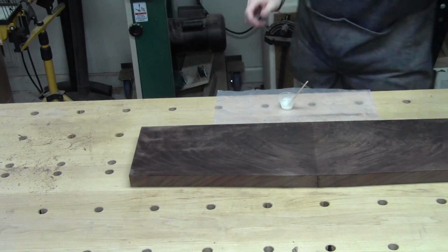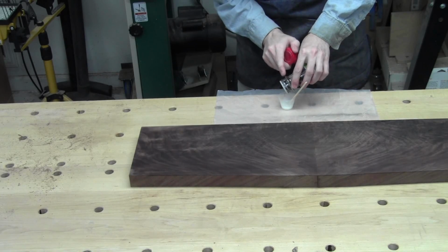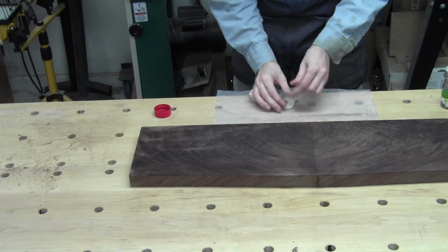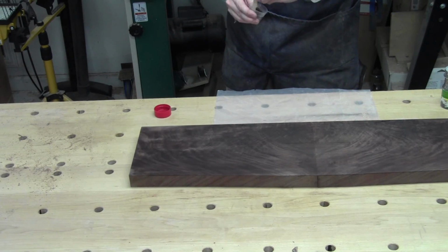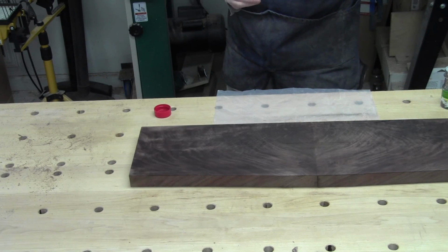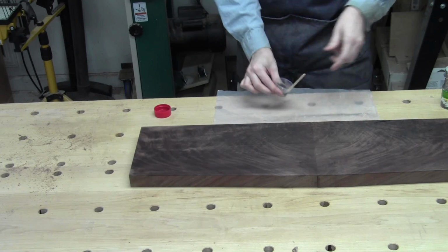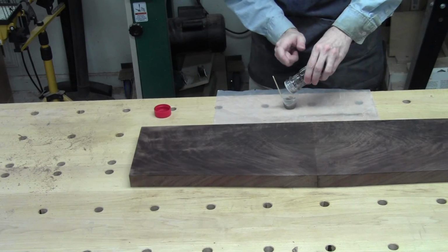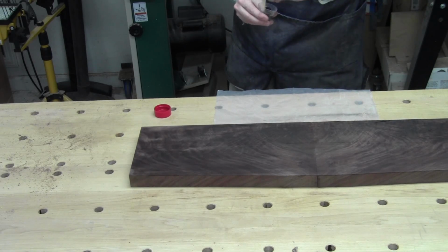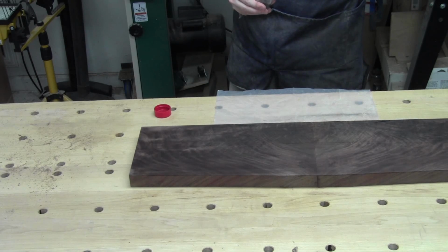Okay. Ebony sawdust here. Just sprinkle a little bit of it in. This is sanding flour. It's very, very fine powder. Now it's a bit brown, but we're going to go even darker than this, I think. And just get it, you know, homogeneous. Right now it's a bit gray. That's probably enough now. Not quite yet. A little bit darker than this.